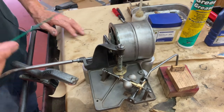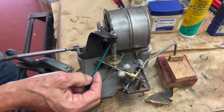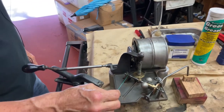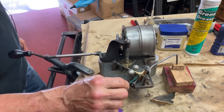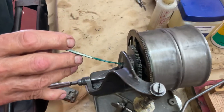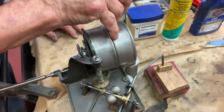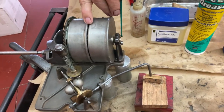With sewing machine oil, you're going to lube the spindle shaft that goes up in here, so you're going to lube it right here. And then on the top side, you're going to hit the spindle shaft with a drop. You're going to do a drop here at the bearing, a drop here at the bearing, and a drop on the leather. Then you're going to come in and put a drop here on the spindle shaft that goes through the spring barrels — one down in here, one down in here, right here, and then one drop here at the top.